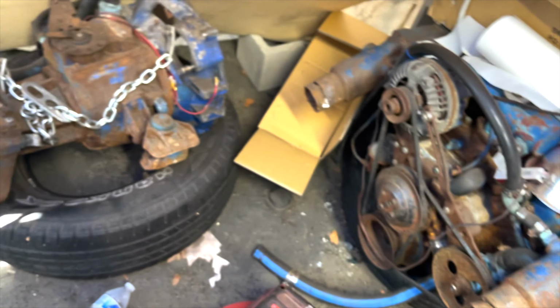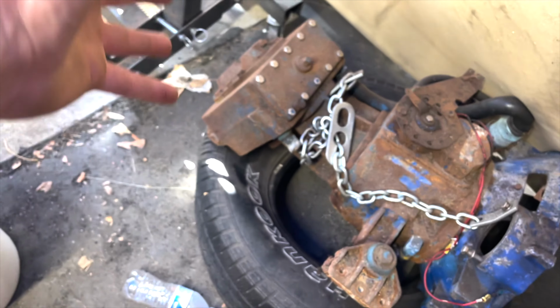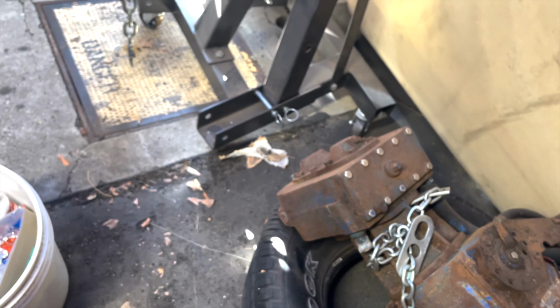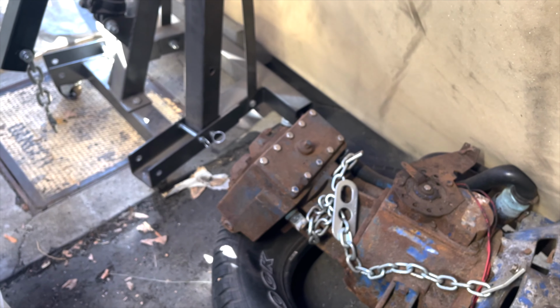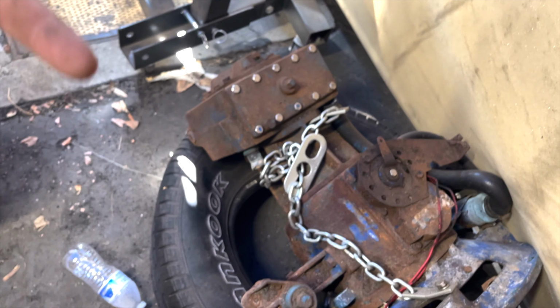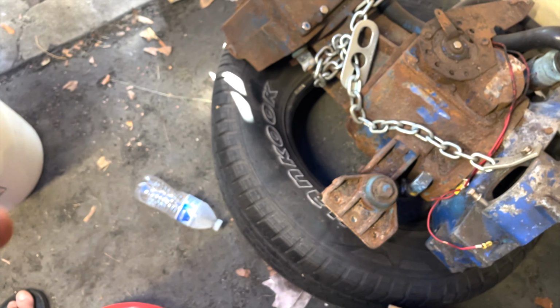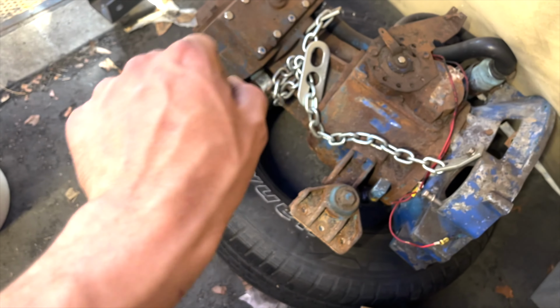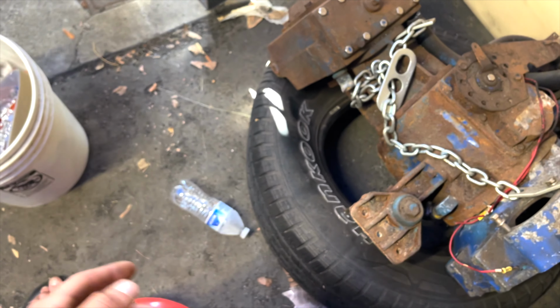Paragon. Now, if you go over to the starboard side engine, why does this one have this giant, bulbous thing over here on the V drive, on the turnaround, like that? That's interesting to me. So this was on the starboard side. I was thinking that it was bigger because it had gears to reverse the actual rotation of a standard rotation engine, so that you would omit having to get a reverse engine. But when it actually came down to seeing, okay, if I turn the drive this direction, which way does the propeller shaft go? They both spin in the same direction. So that wasn't the case.